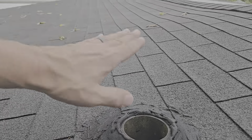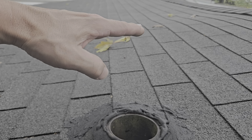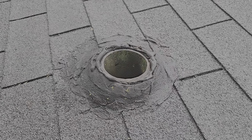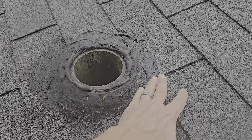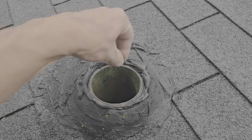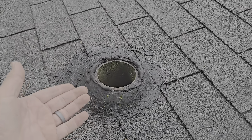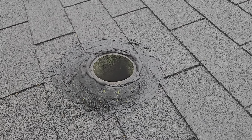What that does is essentially get your pipe up higher, extended off the roof deck, so you can get a pipe boot on it and give it a clean finished look. Your pipe is more important to be flashed to your roof than what little water goes into it. Check the link in the description below or do a Google search if you're not sure what it is. Until next time, be safe.